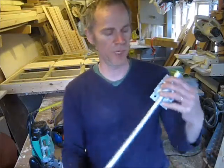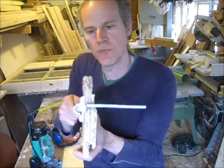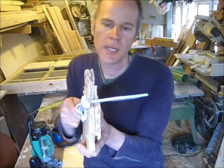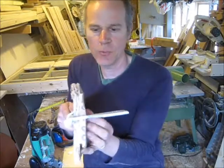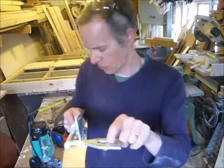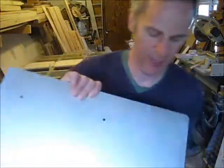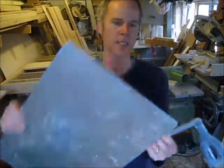I've got to make this bike shed secure, so I've got this big throw bolt. The idea is that it fixes on the back of the door with some bolts through, and this tab here will slot through the OSB and the cladding, then a padlock through that. But we need a plate - I've got this aluminium sheet here, a quite nice thickness.